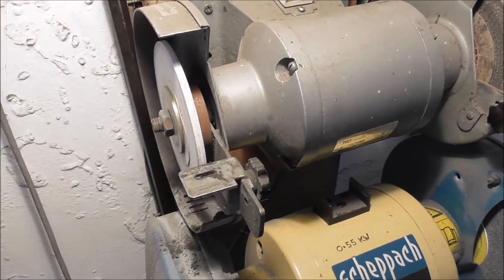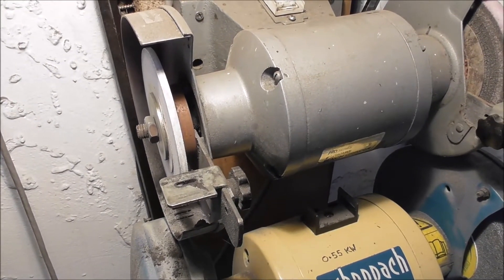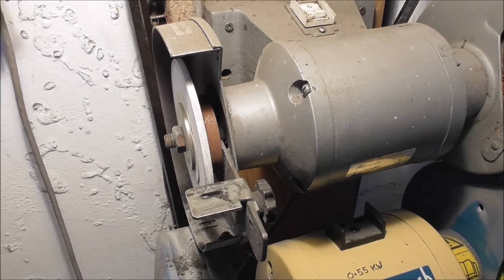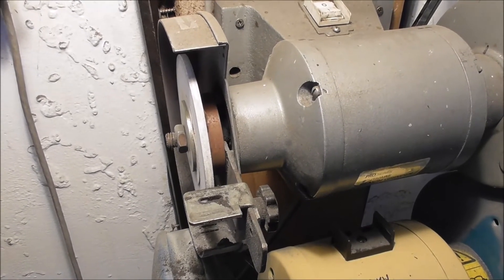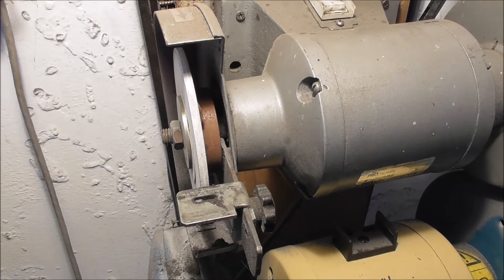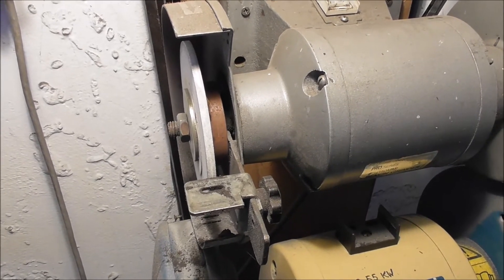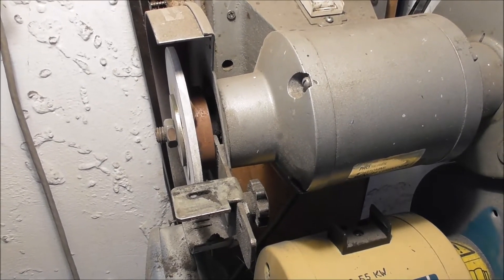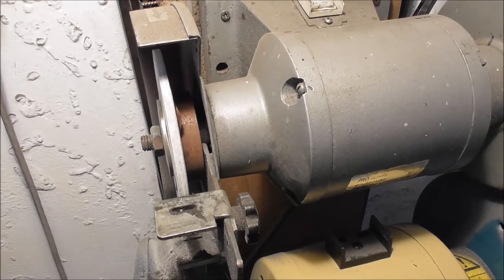With excessive rake to make sure the cutter cuts where it needs to and doesn't rub. If you try to freehand grind the correct minimum clearance on a complicated cutter you'll likely get it wrong on some geometries without realizing it, and the cutter will rub, won't cut at all, and will burr the work. I've found over the years that to freehand grind successfully you need to give it plenty of rake and clearance. Thanks for watching — if you like this type of video I'll be doing more every couple of weeks, so subscribe and hit the notification bell.